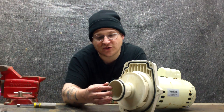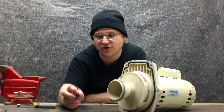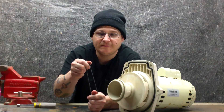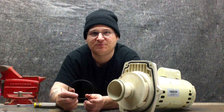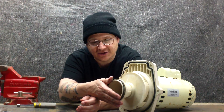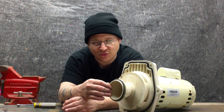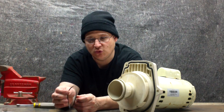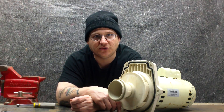Here, we're going to remove this O-ring just like that — that's the diffuser O-ring — and place it on the side of the table. If you want to inspect it, you want to pull it like this. That will tell you if it's good. If it snaps, that means it's bad and you need to replace it. If you pull it a couple times and it's all stretched out and doesn't fit back on, or if it's hanging or really loose, that means you need to change the O-ring as well. Then we're going to come up close and show you how to remove the diffuser bolts.